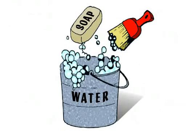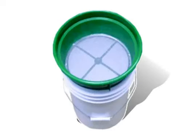Ensure that your pot is clean of all oil, moisture, bird's nests, etc. If your pot is new, it will most likely be shipped with a coating of machinist oil to keep it from rusting. Add your media, being sure to strain it through a screen to remove any foreign debris from it. Sieves made to fit a 5-gallon bucket with precise mesh sizes for different media can be purchased, but a piece of window screen will usually do the job.